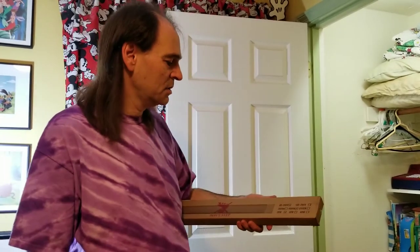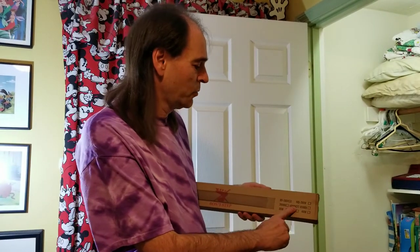Today's project is to replace the fluorescent tube light in this closet with this LED light fixture. We've got a 4000K light, which means it's whitish, but not super white. A 6500K would be really, really white, and a 3000K would be fairly yellowish. It's a 20 watt fixture, which is the same as the fluorescent light that I'm removing, which is also 2 feet long, actually 20 inches.